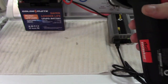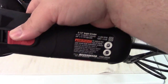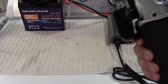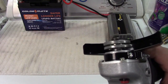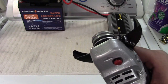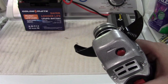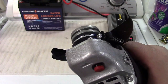Here's an angle grinder. It doesn't say the wattage, but it does say the amperage is 4.3 at 120 volts — that's about 500-something watts. Should be able to run it without any problem. I don't have a blade on here for your safety, but it'll still spin up just fine. Not a problem — it handled that like a champ.